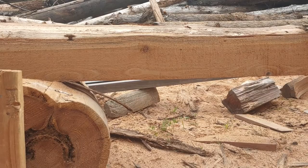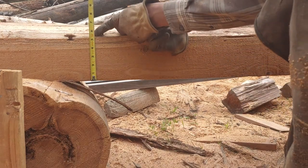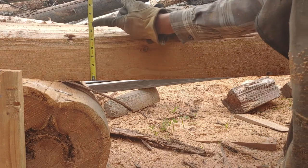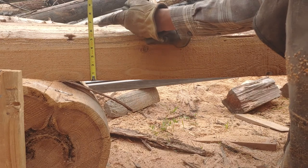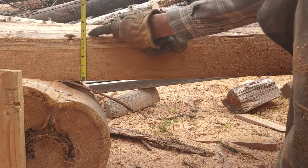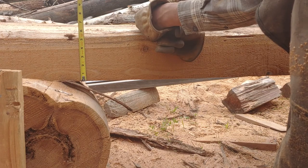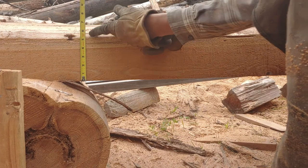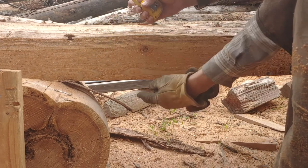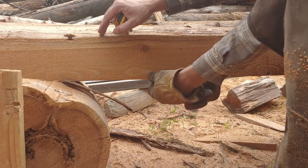I've kind of run into a problem here at the skinniest part of the log. I've got five and a quarter inches right to the edge of the sapwood, with an inch-plus of sapwood in there — so I can't even make a true six by six out of it. I'm gonna make a little adjustment and cut it at five and a quarter so I can have essentially a flat face on this fourth side, making it about a five and a quarter by six. I kind of got jiggered around by the sweep and the bugs, but we can still get some good wood out of this — we just have to adjust our plan a little bit.